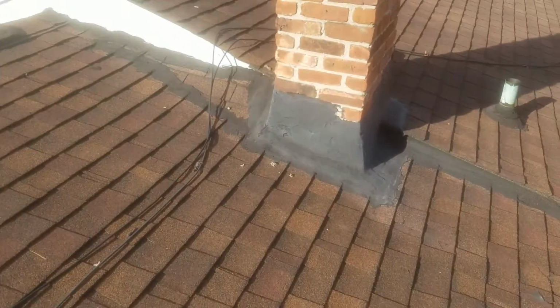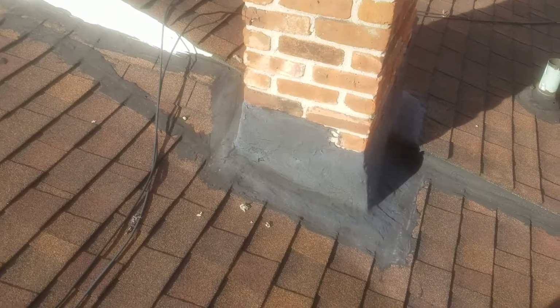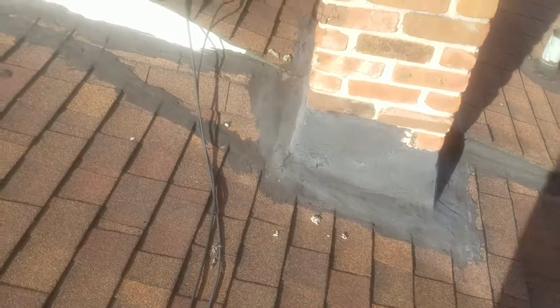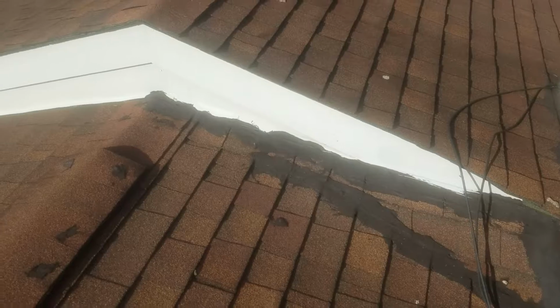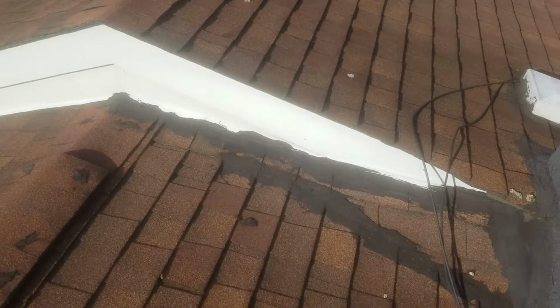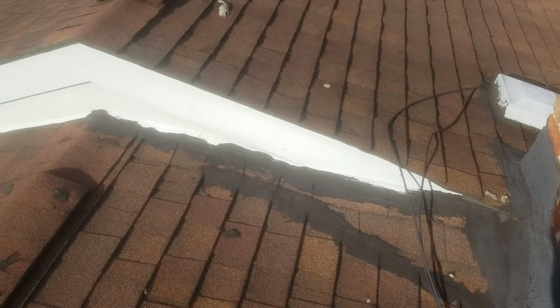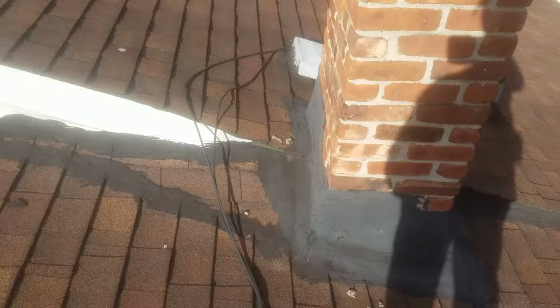As far as the chimney here, all of this here would come out of there, and I would cut brand new lead flashing into this whole entire chimney. So I would cut it in on the cricket and around the chimney there. There'll be no tar here, of course. I'll put brand new flashing up at the wall. I'll bend brand new trim, that white trim there, because you'll never get the tar off of it now. So I'll bend new trim and put that there too.